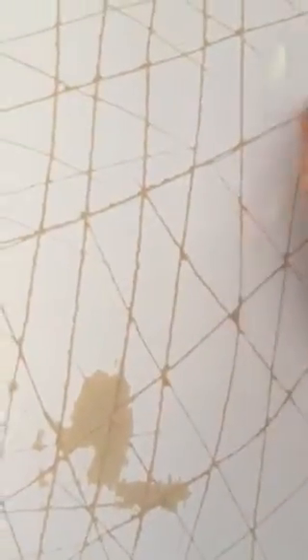In a test area, some of the adhesive has actually gone through and you can see the squeeze through. I tried getting it off and it is absolutely bonded — you can only get it off if you pull the plaster off. It's a huge job to try and get all the emulsion off, and my advice is you don't have to do it if it doesn't flake off.